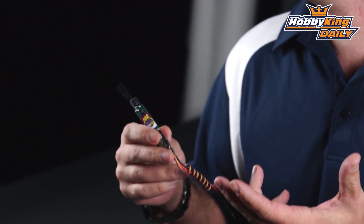Let's talk about some of the features of the ESC. It is SimonK, so it has up to one kilohertz input — ultra fast, designed by SimonK and TimeCop as far as software and hardware are concerned. It's 20 amp but definitely capable of a little bit more than that. It also has I2C on it, so for flight controllers that utilize that for communication instead of the standard RC, it has those pads on there as well.